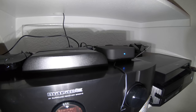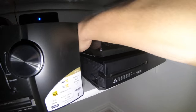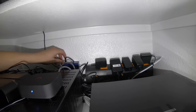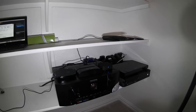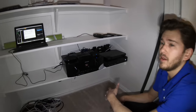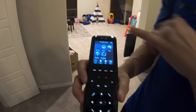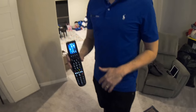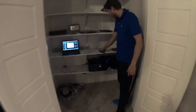We put a wireless kit on the sub because the termination was in the front of the room and we wanted better dispersion throughout the space — it's performing really well at the back. We have a Sony 4K Blu-ray player, the X700, and an Xbox One. In the back there's a Watt Box surge protector and a network switch — the surge protector filters out line noise and protects from lightning strikes, and the network switch gives them maximum speed which is very important for streaming 4K content. On the remote they have options for Blu-ray, Roku, Xbox, Chrome, and Bluetooth — one button press turns on everything associated with that device and sets the correct input. We put a little charging station there so they can keep it charged all the time.